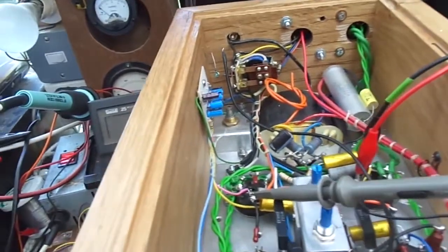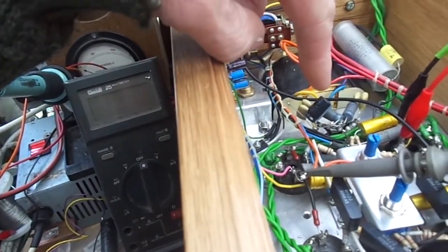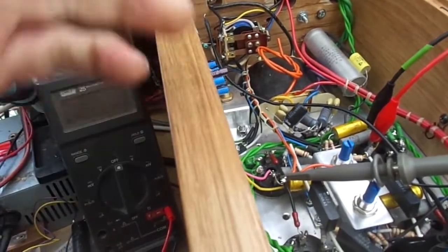It's the next morning now, and I just unsoldered this decoupling cap, and what I noticed was that possibly, see that joint there where the scope's on, I thought, hello, is that touching the cathode? Could that be causing the issue? Let's pull that up and see if it goes away. The answer is no. Now look at this curious behaviour.